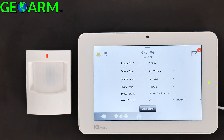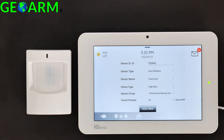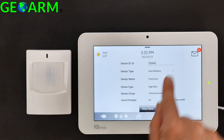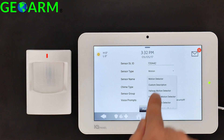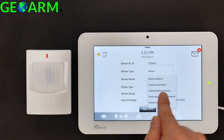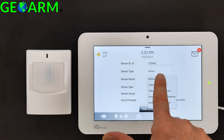Simply select OK and here you are. This is one of the things we love about Qolsys — they make the programming process a breeze, very straightforward and easy. The DL ID is in there. For Sensor Type, we don't want door or window contact; go ahead and select the arrow and select Motion. For Sensor Name, it defaults to Motion Detector. You can keep it or enter a custom description, but for a motion sensor it doesn't really enunciate much, so I'll keep it at Motion Detector.